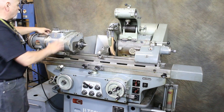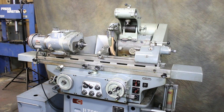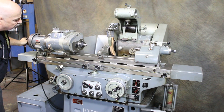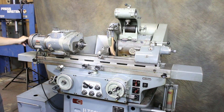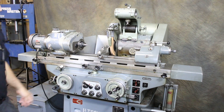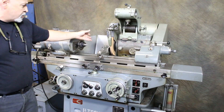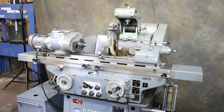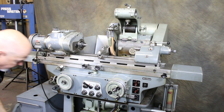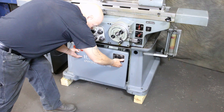The headstock can be made live or dead by switching a simple knob in the back of the unit. There's a mounted hand wheel so you can rotate your chuck or workpiece — very convenient. There's a table-mounted dressing device, a balancing arbor, a tool to extract the grinding wheel, and here you have your hydraulic unit. The electrics are all in the back of the machine.